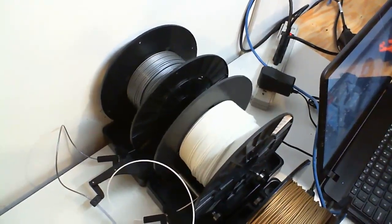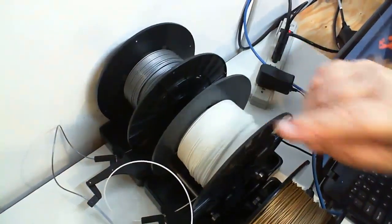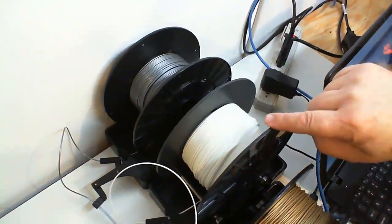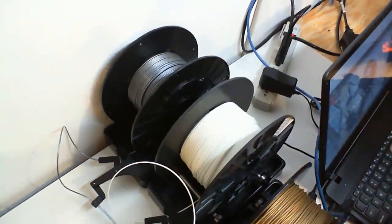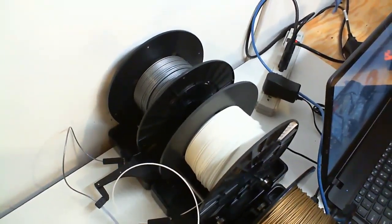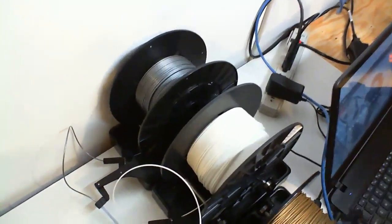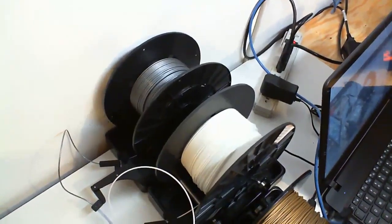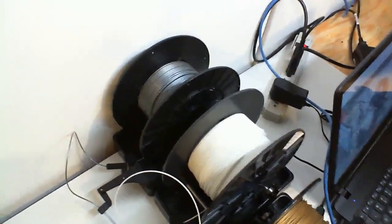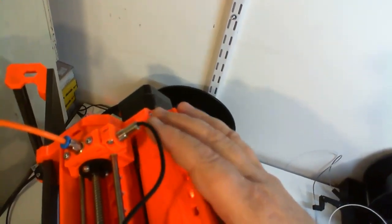And I'm wondering if, when I'm setting this up for calibration, those feeder rollers are slipping, and that's causing me to get miscalibration for the loading length, and then it fails during the print because it's either pulling it back too much or whatever. So anyway, what I'm going to do is update the firmware. I'm going to recheck the Finda sensor and make sure that that's right.